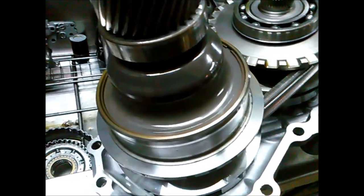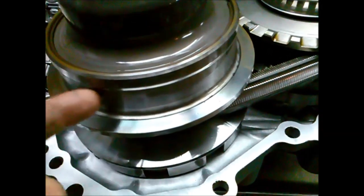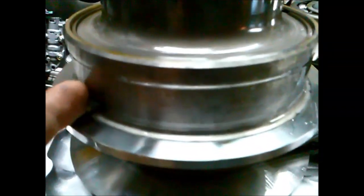I'm making a CVT puller tool. I've just got a flat bit of steel — it's one inch wide. I've pre-drilled quarter inch holes and bent it one inch from each end, top and bottom. The length of it is 17 inches, but I've made it at 16 and three quarters so I can wrap it around there. You can see there's a little step there that holds it on.